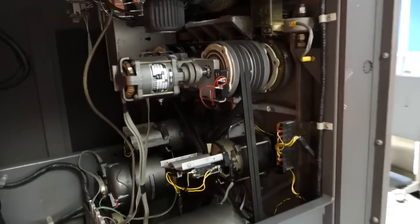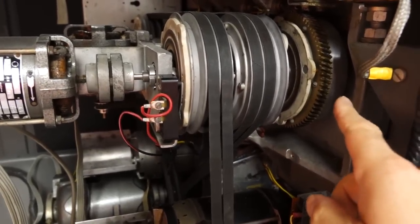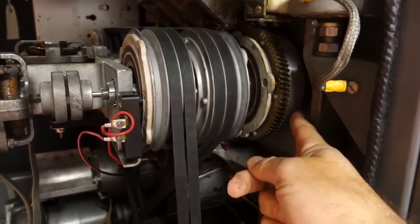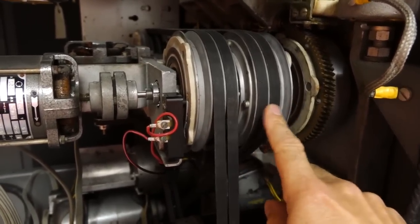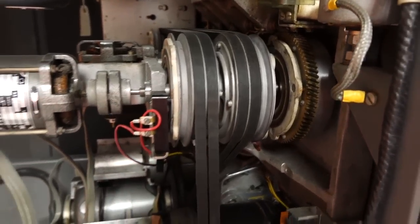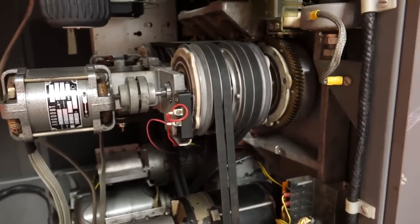So now I want to draw your attention to this assembly here. This is a series of magnetic clutches, and they are used to clutch in and out the different motors that we talked about. This one is used just for load, and these are the 2 main clutches for backwards and forward. So what happens, the motors run continuously, the big ones there, and they are just clutched in and out, which allows the hub to accelerate so fast and gives it this funny jerky motion.